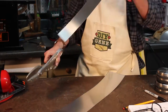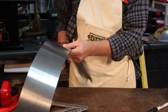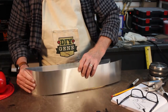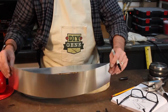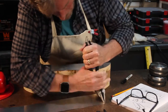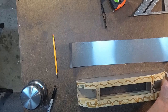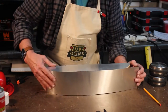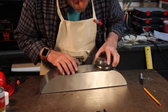Now I'm going to cut a four inch wide piece that's going to make the curve on the front of this. I came in about a half inch and, using a pair of duckbill pliers, I'm going to make the bend. I think I paid less than $10 for these at Harbor Freight — I'll put a link in the description below. I measured that around and took those pliers again to give it a decent bend on the back side. Using the medium glue — you could also use the thick glue for a little more time to set. I used the medium glue and had to move very quickly. It fit really nicely, and after I made sure it was all down, I came in and filed those edges smooth.